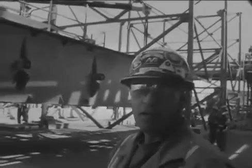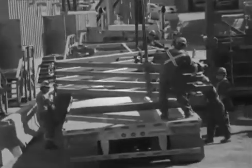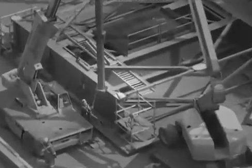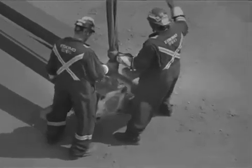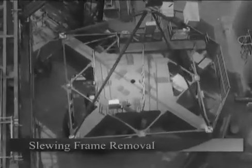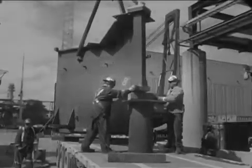Here we are on Saturday morning — we've just brought down the main jib crane. This piece now on the ground will allow us to dismantle all of the tower sections. We can now pick them up, set them on top, bolt them into place temporarily, and dismantle them piece by piece, loading them onto a truck and removing them from sight. This is a major milestone for us as it now allows us to dismantle and remove the rest of the tower — another eight sections. It took us 43 days from when we pulled the first counterweight off to when we actually lifted this piece off.